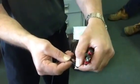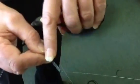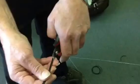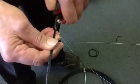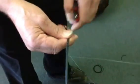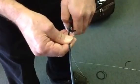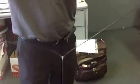Now, look at where the two grooves are — the grooves from where the strength members were sitting — and you cut along there. Not along the face where the printing is, but along this face here. You can use side cutters or a pair of scissors. Cut a reasonable amount, enough so that you can grab the two ends and separate them, then pull them apart all the way down to where you've stripped.